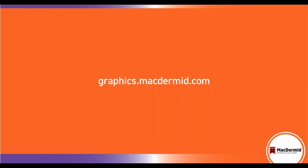Any plans to introduce this plate with a surface structure for better ink transfer? I'm sure they're referring to our Epic surface structure. Yes, actually no plans to do anything with regards to a cap structure, if you will, or a surface engineered surface on this one. However, we are looking into the advanced screening capabilities that the prepress manufacturers have out there to see if this particular plate offers any opportunity to utilize some of the advanced screening concepts to help that area. This does transfer ink very well too.